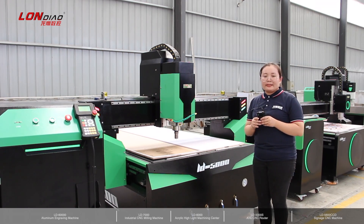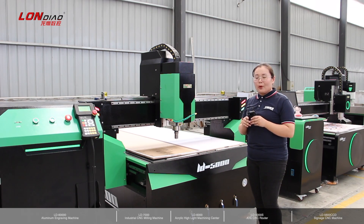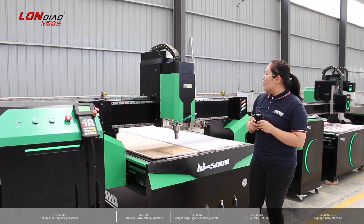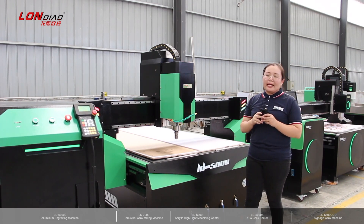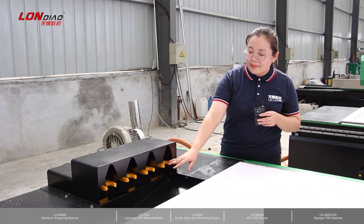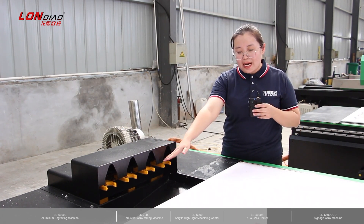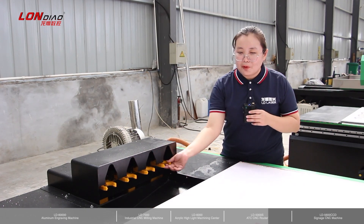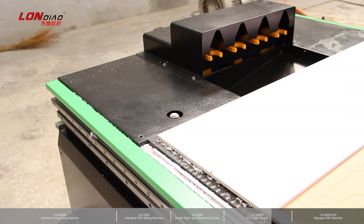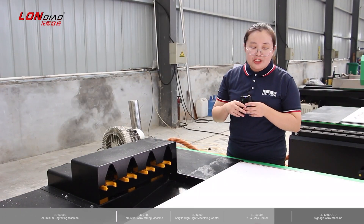This model is 4 by 8 feet and we use a walking table with T-slot. The controller is the Weihong DSV control system. In the back side is our tool changer magazine — it's a cylinder design. When the spindle comes out to touch the tool holder, it stays, exchanges the tool, then returns. That part is our tool sensor for each tool's original position setting.